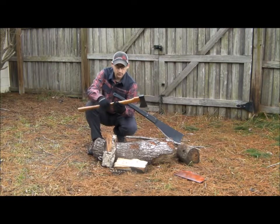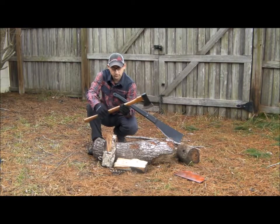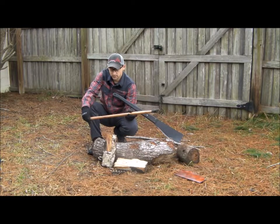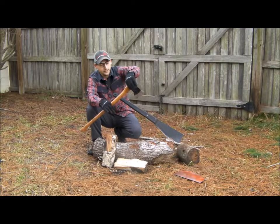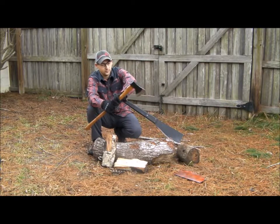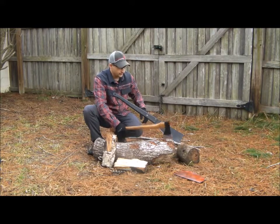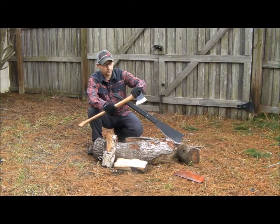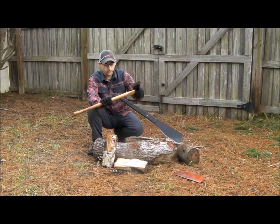When I got it, I sanded down the light coating they had on the wood to get down to bare wood, then stained it with a slightly darker stain to bring out the grain and make it look even prettier — I love hickory and wood grain. From the head of the axe down to about mid-handle, I applied a couple coats of polyurethane as an extra protective barrier for when the axe comes off wood or you're rocking it out of a log. It protects the hickory from nicks, scratches, dings, and splintering during heavy use.